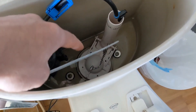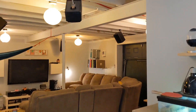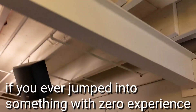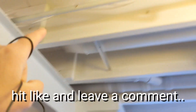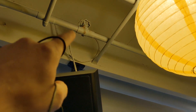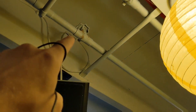The initial problem was the rubber flapper underneath that was coming off. When I went to turn this off, that's the first one that broke. Over here is where the bathroom is. The toilet supply line goes that way — that's a half-inch that branches onto a three-quarter inch pipe, and there's the valve that's broken. You can see it's been corroding there. This one needs to be changed too, but I'm just gonna do one today.